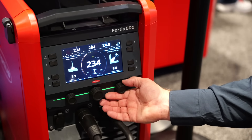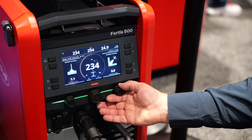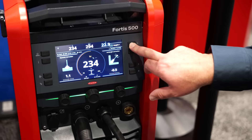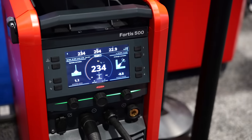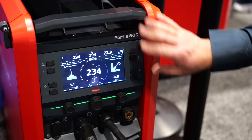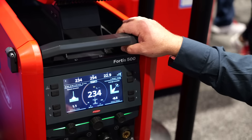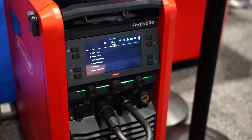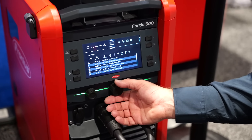It gives the entire range of welders — anyone with maybe less experience — a visual on what the weld is going to look like. Once you find something you like, you've got your radio buttons over here: press and hold and you've saved your station. You get four presets right on the machine, and if you have a manufacturing process that requires more, there's a software option where you can actually have a thousand jobs — store all your WPS's and different setups.